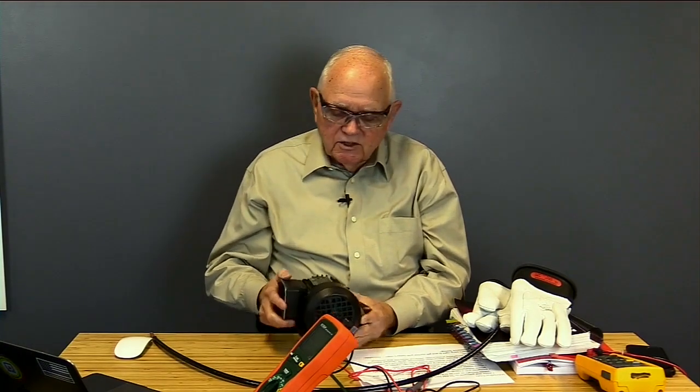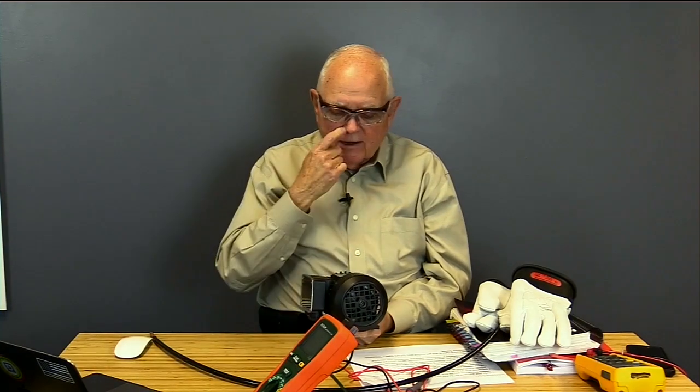I can watch that happen over time, by the way, right? I can not only do a test today to determine if this motor is good or bad, but I can also watch that insulation break down over time. So let's say today if I ran my test and I had 100 mega ohms of resistance. I come back in 6 months and it's 60 mega ohms of resistance. And I come back every 6 months or whatever my schedule is, and I can actually plot out and watch that insulation breaking down over time, 60, 50, 40, 30 over the years, whatever. And I can predict maybe even when it's going to fail.